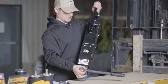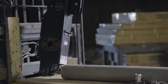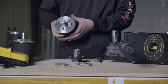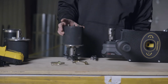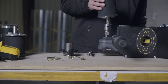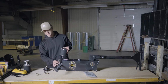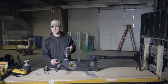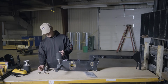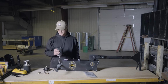So that would work like this, and this end would obviously be connected to the pipe, so you can let go, and it's just going to sit there waiting for when you want to use it next. Show you how easy it is to swap your pipe ends. So literally, you're dropping in there, putting your pin in. If you need to swap your drill to the other side, you pull out your 2 pins, move over. The same connection. With our old system, this end actually had a chuck in here where you had to pop a pin. You had to have a special pin for it. And the other end was just a little pin. So that way you actually couldn't swap your pipe around. You had to move your whole setup around. So this will be a lot quicker.